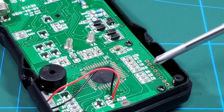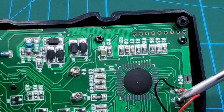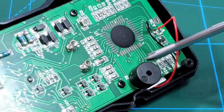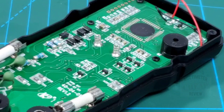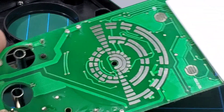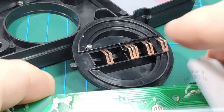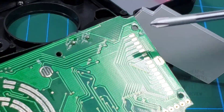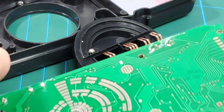There's a programming header for factory settings. At the top we have our speaker or transducer. Looking at the NCV — interestingly I don't see any filament whatsoever. The two wires feeding the display are giving us the illuminated backlight. Pulling it apart further on the other side — soft-touch buttons, the main rotary with a little bit of grease. Flipping over the display, surprisingly the NCV is absent — it's just a filament in the PCB itself providing non-contact voltage detection. No extraneous protrusions.